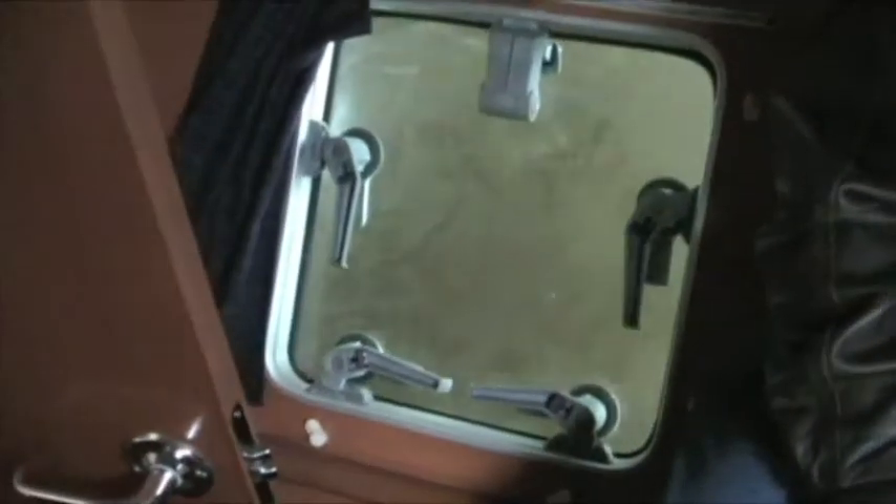When you've got 12 batteries in parallel and in series, you've just got to be aware that in terms of battery maintenance, things like this will happen. You could have one cell collapse in one battery and your overall battery voltage is affected. I've got enough space to put a 13th battery, so I've set it up so that if the occasion arises, I've got a spare battery.